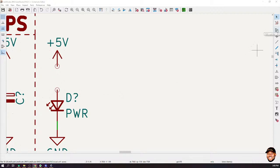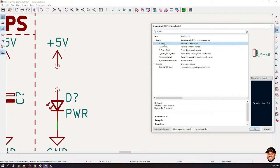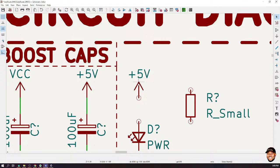Yeah, that's fine. So the next thing we're going to do, right now we know that if we want a current of 10 milliamps to flow through this, then the resistor value that we have to use is 300, right? So for now, let's just drop it in. I'm going to bring up a resistor. To set a resistor, you go to R, okay? But this time I need a small version. And then unfortunately it won't fit. So let's do some adjustments. Oops, I have to sacrifice this.